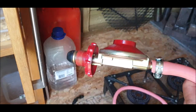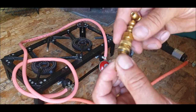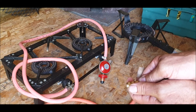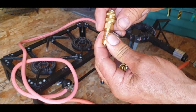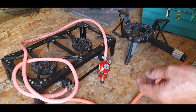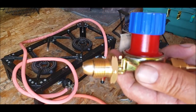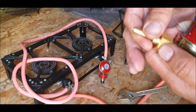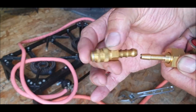I'm going to swap them for something else. These are propane-butane connectors off eBay. They separate, so what you do is connect one end of the hose into that — you'll have to cut a piece of hose and put it to the new regulator. The new one has a brass fitting at the end, which is fine. The nozzle on the end is an 8mm nozzle, so I've got to cut a piece of flex, put it on there, and then put on this adapter.